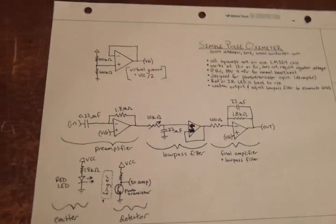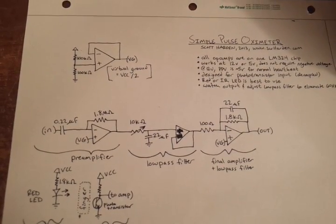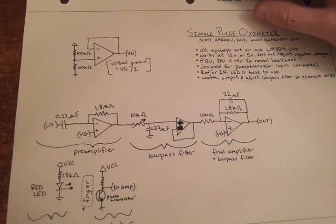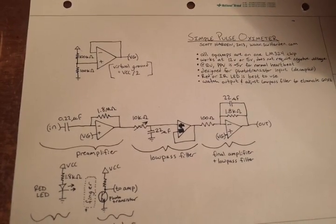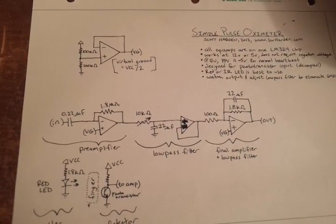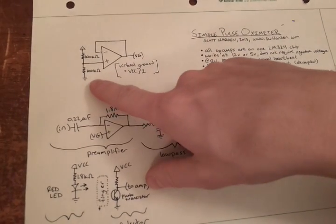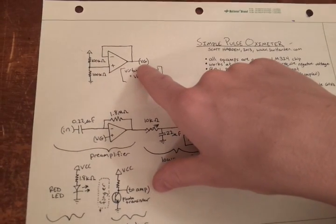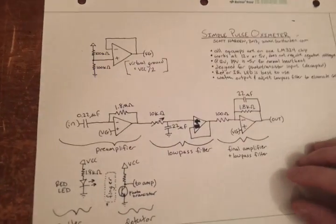The first thing I want to talk about is that we are not driving the amplifier like it's often driven, where we have plus a certain voltage and minus voltage. Instead, we generate a virtual ground. This makes it easier because we don't have to worry about plus and minus voltages — we can just use plus 12 volts and 0 volts, as opposed to plus 12 and negative 12 volts. To make a virtual ground, we use a voltage divider generating about 6 volts as the virtual ground output. So we call 6 volts our ground, 0 volts is like our negative 6 volts, and 12 volts is like our plus 6 volts.